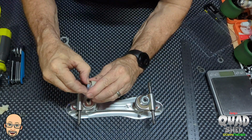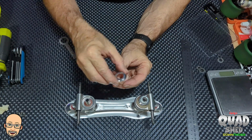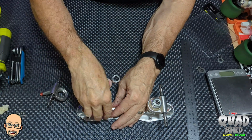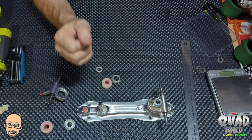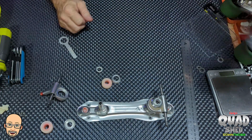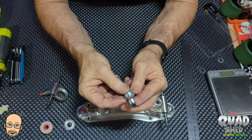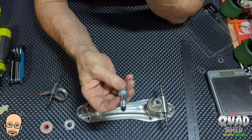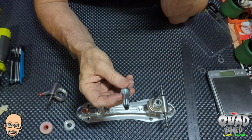All right, so we have a separate locking nut, as in we have our washer and we have our cushions. Now, the one thing I wish they hadn't done is gone to a thicker kingpin. It's a lot thicker than the standard kingpin that was on the LXT Zap, which is pretty much similar to what a Bowen is. They're all the same size kingpin.